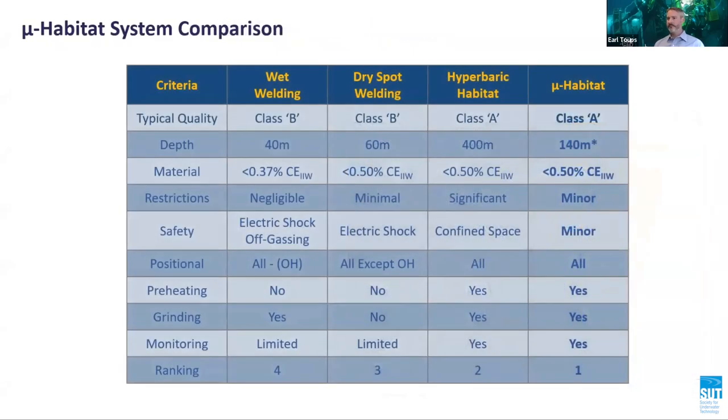Of course, the microhabitat has its limitations. These come in the form of brace severances. The central underlying premise to an integrity strategy should be a conscious effort to minimize the risk of brace severance. A robust program of subsea inspection and monitoring, complemented by an effective repair readiness strategy, harnessing the flexibility of the microhabitat, offers operators the best chance of avoiding a severance scenario.